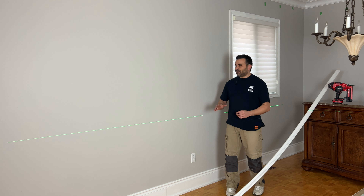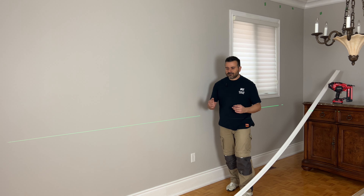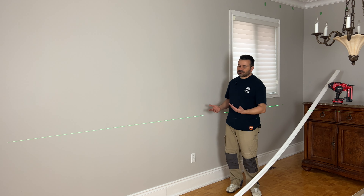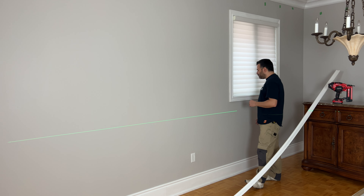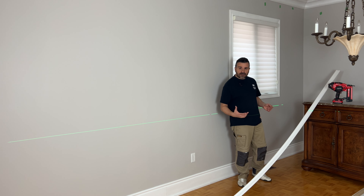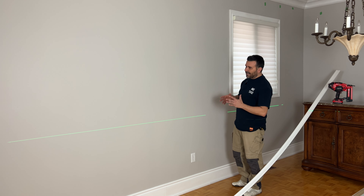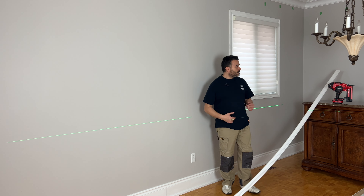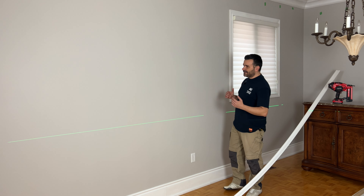Other than that, your basics: tape measure and pencil. Now to keep a nice straight line, I'm using a laser level. If you don't have a laser level, no big deal — grab your tape measure, mark out your wall, works just as well. This is just a little bit faster. I'm starting with the longest wall in the room — this is 22 feet exactly. I'm using a 12-foot length of chair rail, which is great because I'm only going to have one joint on the wall. I'll make a scarf joint, join that as nice and cleanly as I can. The ends will just be butted right to the end of the wall because the piece that comes to join it will be coped for a nice clean joint.